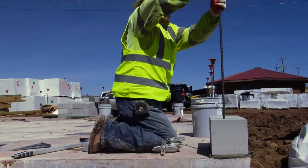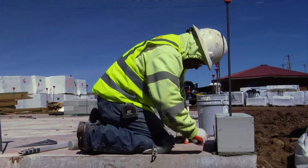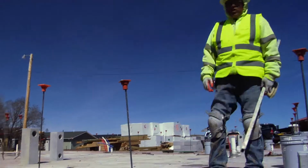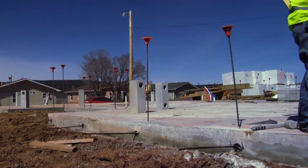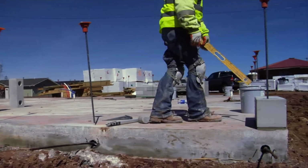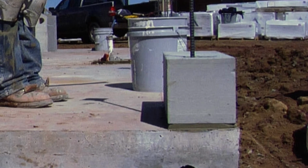Of course, you've got to put your rebar cap back on, and then you just clean the edge. What I usually do is set all the corners like what I just did. Set all the corners, then come back around and run my string line. Run a string line across and then go by the string line and my level, just using the bed mortar and the thin set. That's the only time we use the bed mortar is underneath, that's it.